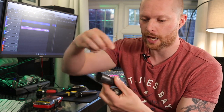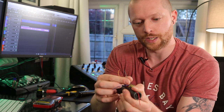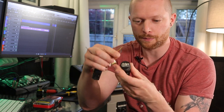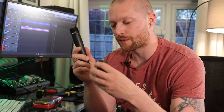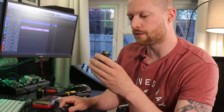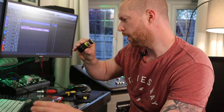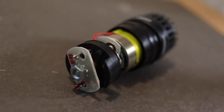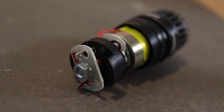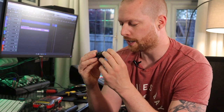You need the blue and red cable going to the XLR end, sticking out where you plug it in. The green and yellow cables will poke out the top to the capsule, and that's what they attach to. Colour-wise, I took apart the SM57 and the green goes to the positive lug and the yellow to the negative. On the replacement capsule I bought, it has a plus and minus sign, and they've also coloured the positive one red, which is nice.